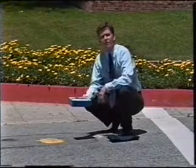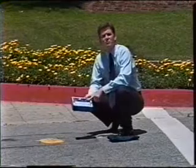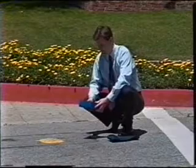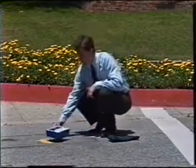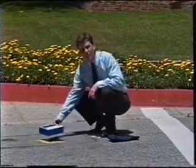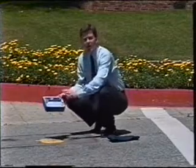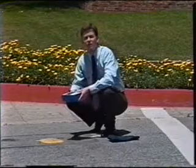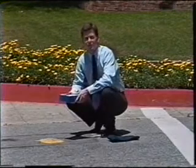We would rotate the instrument onto its back, press the locate mass button, and walk around the area looking for the mass of metal. For example, every time I pass over this valve cap, we get a change in tone. If this were paved over, that would indicate a mass of metal below the receiver.